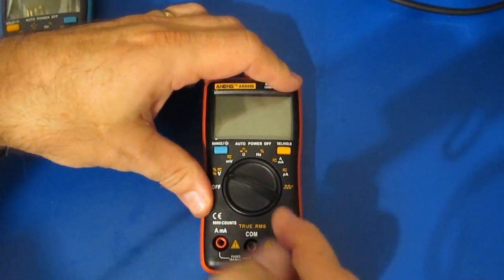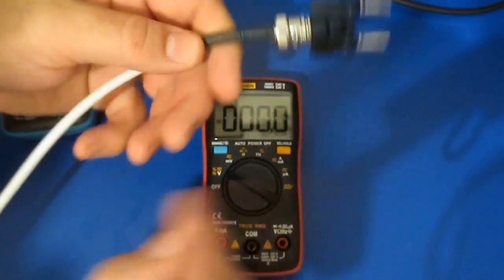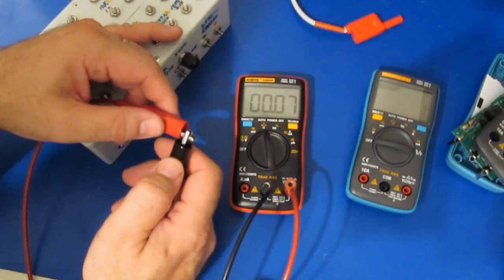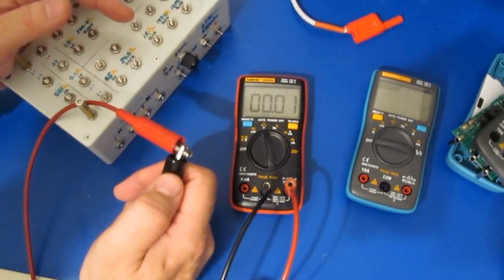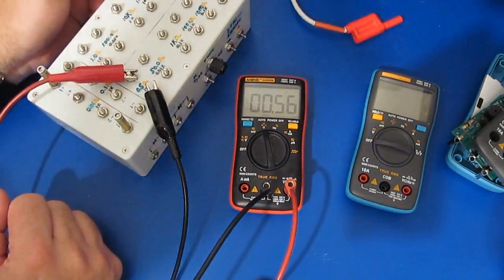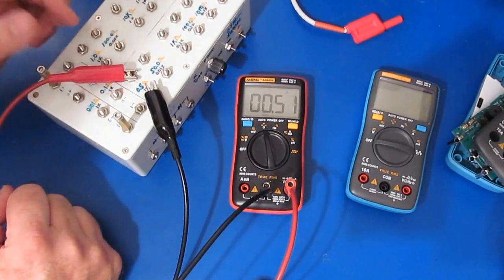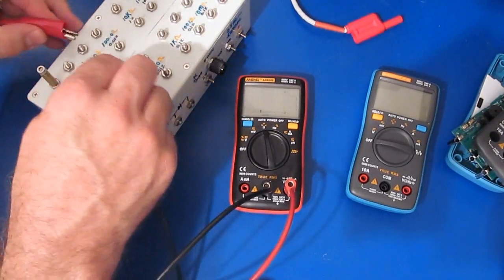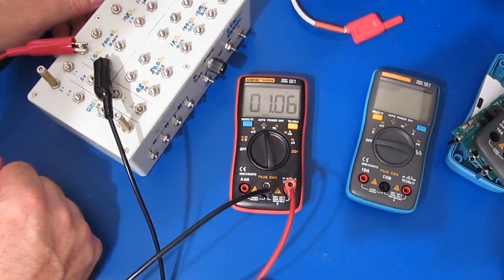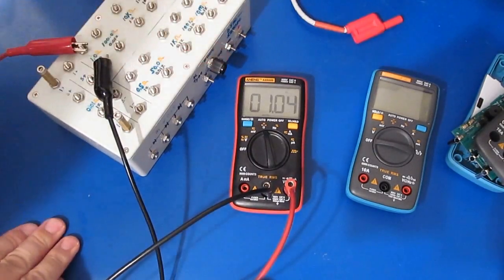Check that out. I'll just disconnect the input. There you have it. Again, 3 volts coming off of this thing. That's it. 20 dB. Takes a little bit to get down there. You see it just slowly drifts down to 0. Not the fastest meter. So this is with a 0.5 ohm resistor. Again, this is a 1% part. Looks like 0.51. This is a 1 ohm 1%. And you can see it's just slowly drifting downward.